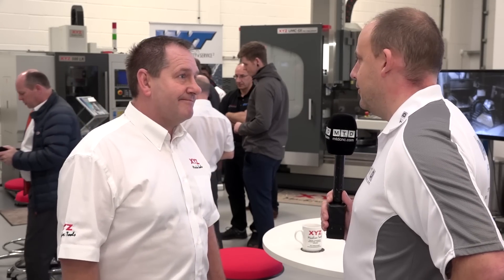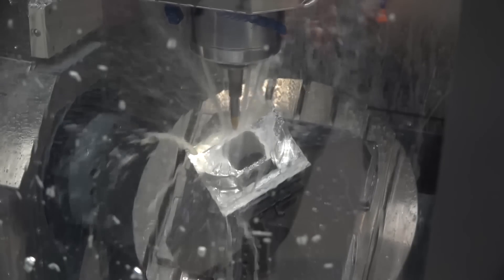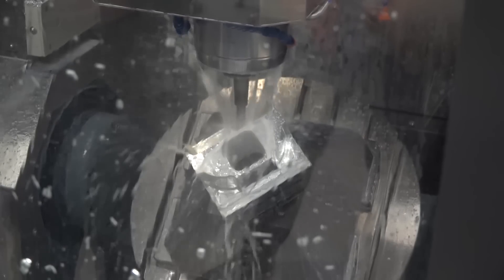I've seen a few jaws drop today - mine being one of them. Do you think it's really got these guys excited? Yeah - when you're machining with five-axis and the angles you can achieve, it's actually ejecting the chip. Normally you'd be interpolating down and crunching, trying to get the chips away with through-spindle coolant. But with the tool angled, it's ejecting the chip, which is a fantastic big benefit.